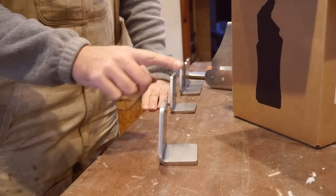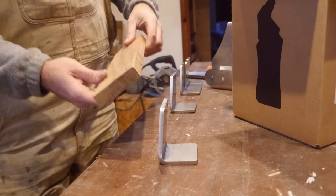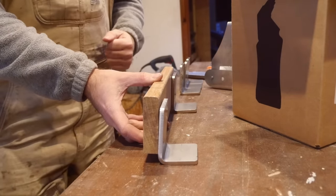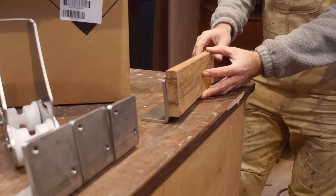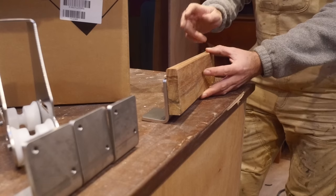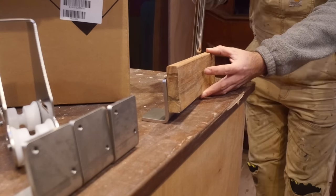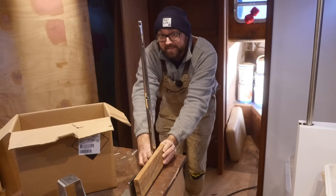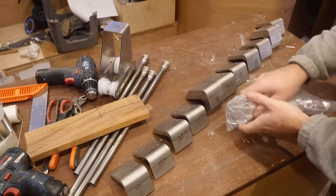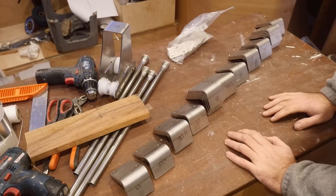Up on deck there's going to be about a meter between each of these, and then all the way along the deck hull joint I'm gonna have a piece of wood that's 80 millimeters high — so something like this bolted to them. This is my alternative to an aluminum toe rail that's going to be crazy expensive, plus I think this will look pretty cool. Now at every other one of these little brackets, there's going to be room for a stanchion. I also picked up these spiffy laser cut backing plates. I think it's gonna be a very strong and sturdy solution.